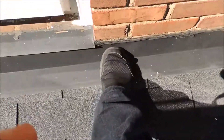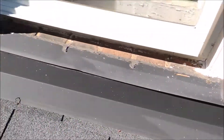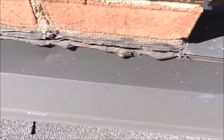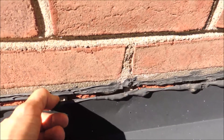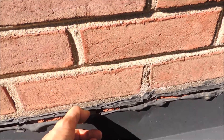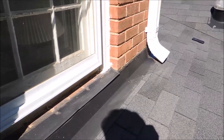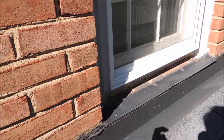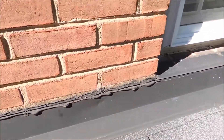Okay yeah, there you can see there's a space right here — the sealant has given way. So we're going to seal the apron flashing along the wall, and here you can see it's all wide open here as well. The best thing to do is take this apron flashing off and we're going to cut right through the mortar with a diamond blade — it'll be about a three-quarter inch cut. Then the apron flashing will be L-shaped and we'll insert it inside the mortar and then seal the outside edge.